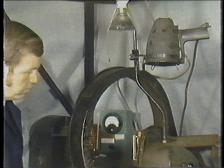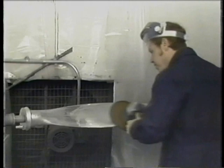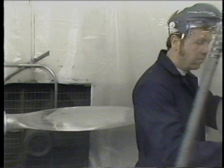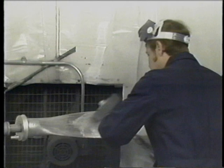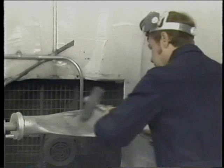It is necessary to re-grind the blades — removing enough material from the blade surfaces to remove corrosion, nicks, or scratches. This process must be performed on all surfaces of the propeller blade. Following the grinding process, each blade is buffed using a soft buffing wheel, which tends to blend in the scratches placed in the blade by the blade grinder. Once the buffing process has been completed, the blade is now ready to be anodized.